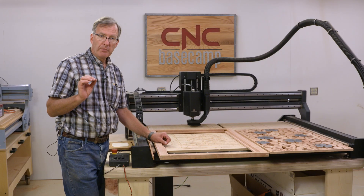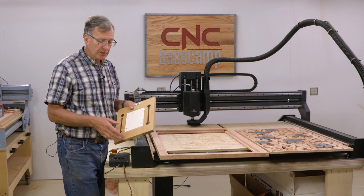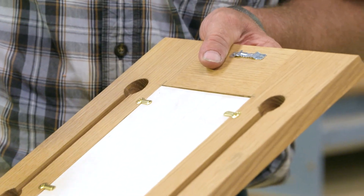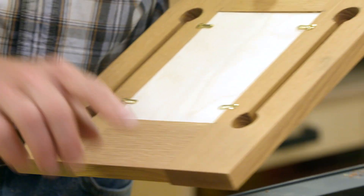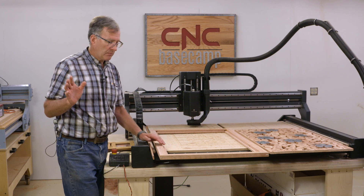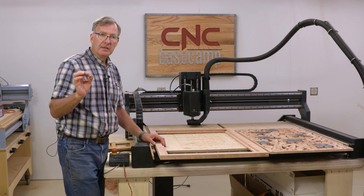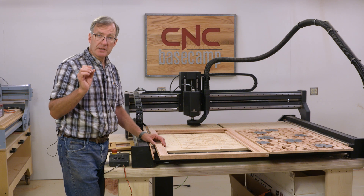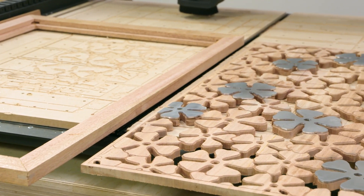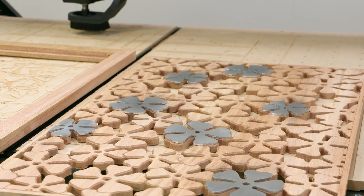Another great way to hold a panel in rather than wood strips is to use the same hardware we'd use for a picture frame. These half-turn brass buttons do a great job — they'll hold the panel in but won't retain any water. When it comes time to mount the project, make sure you have an air space behind it. We want to choose the right material that won't rot, use the right joinery and glue, and always look for methods to promote no water ponding and good air circulation. If you do that, you'll have a great trellis.